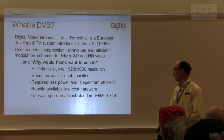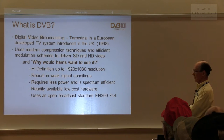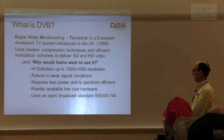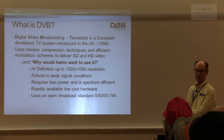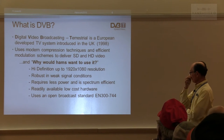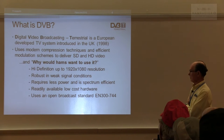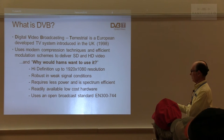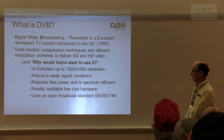What's DVB-T? DVB-T is the terrestrial version of digital video broadcasting. It's a TV system that was developed back in the UK in 1998. It uses modern compression techniques — that's MPEG, H.264, advanced video coding — which is what our vestigial sideband system ATSC in the U.S. uses as well. These are modulation schemes that are very efficient, and they're able to deliver both standard and HD video.